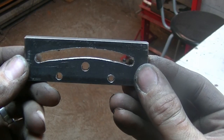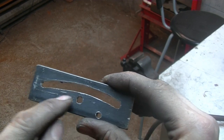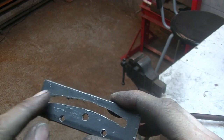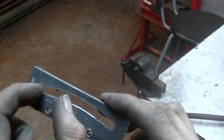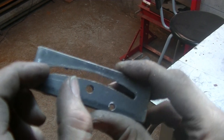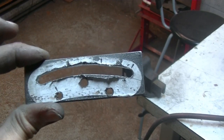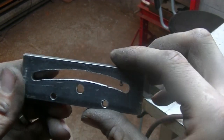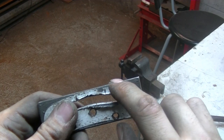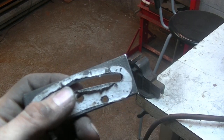Okay, it's not 100% perfect — there's still a little indentations in a couple spots from the drill bits. We're going to make a die block that actually rides in here and it's going to be pretty long, so it might be that these little indentations don't matter. I'm going to leave it like this for now. After I make the die block we're going to tweak this so the die block moves back and forth smoothly. Now I'm just going to cut off the bulk of this stuff with the angle grinder and then profile it with the file.